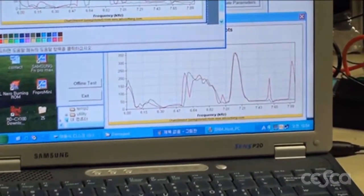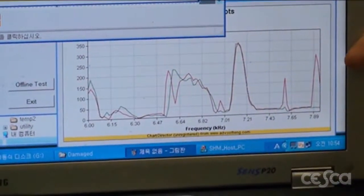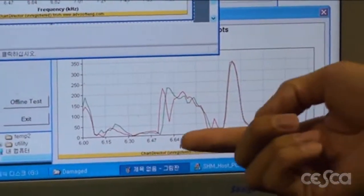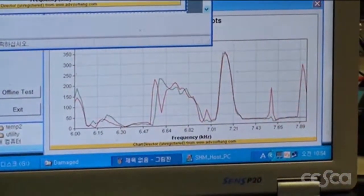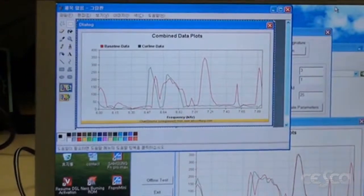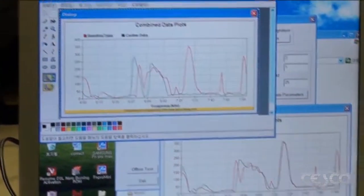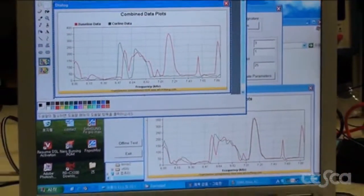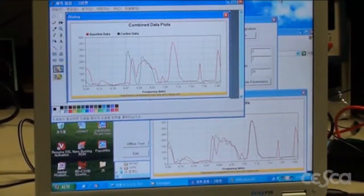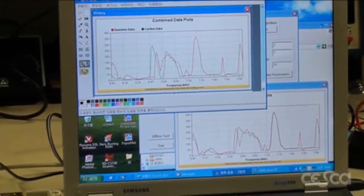When you compare the most recent run to our initial baseline, you can see that the differences between the two signatures are relatively minor. As a reference, here we can see the first run we did after loosening the bolt. As you can see, the differences between the baseline in this case are much more pronounced. By heating the SMA washer, we were able to approximate the state the system was in before the bolt was loosened.